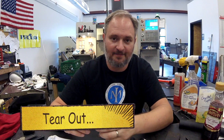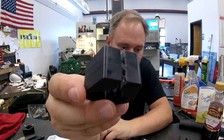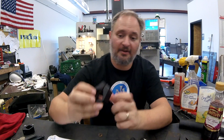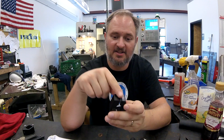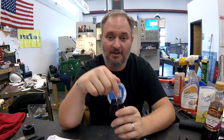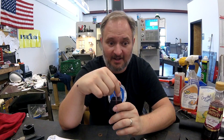Plastic will deform rather than cut, so you've got to be aggressive with it. Other signs that you're not being quite aggressive enough — and some of this you just can't get around — plastic leaves strands, not just burrs. You see all that? There's nothing you can do about that. As the cutter was coming through this edge, it leaves burrs on it. If you wanted to come in with a finishing tool and put a chamfer on there — five thou, ten thou — it's not going to cut it. It's not engaging the material enough. You really need to be closer to 20 thousandths before you're actually getting in there and doing it. You'll get a chamfer, but then you'll still have that same tear-out. It's different from metal — not a bad thing, just different.